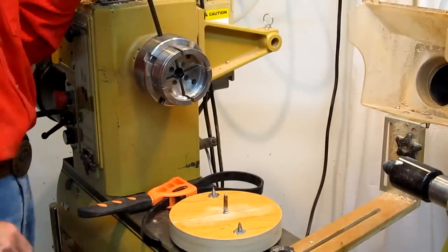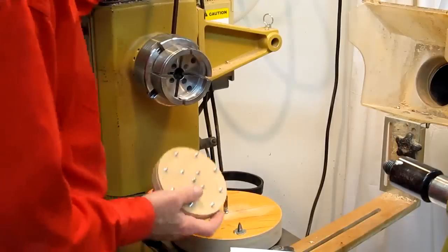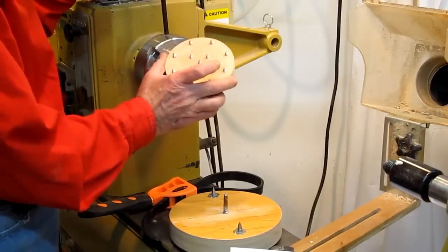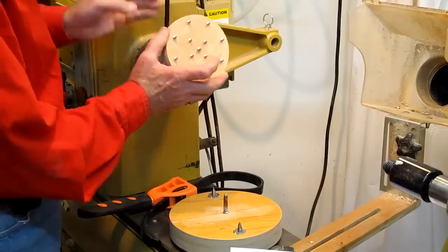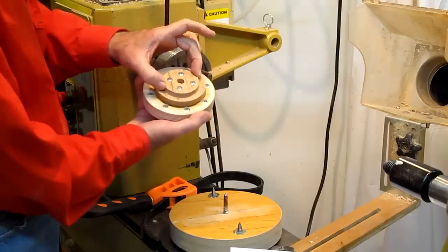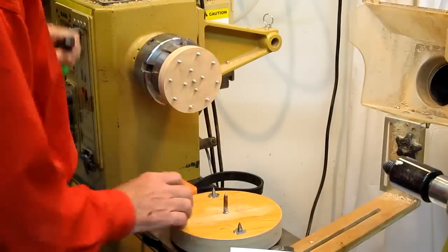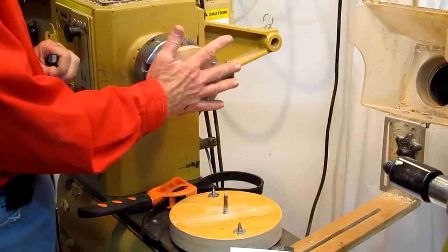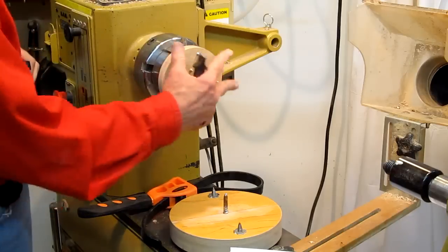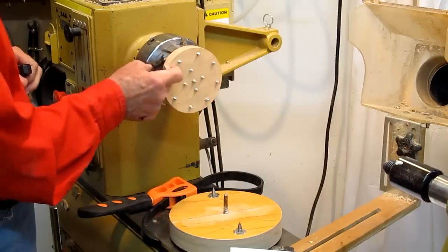Another driver — this one was from somebody on Sawmill Creek, Jerry Marcantel — and he calls this a Marcantel driver. You use a bunch of screws and cover up a wooden face plate, and you can put different uneven surface wood on here. I have two size tenons: one for my Nova Supernova 2 chuck and a larger tenon for this one. If you had a large blank, you can actually use this instead of a normal two-prong driver, because it gives you a larger surface to snag onto that wood with an uneven surface, which can work real well under some circumstances.